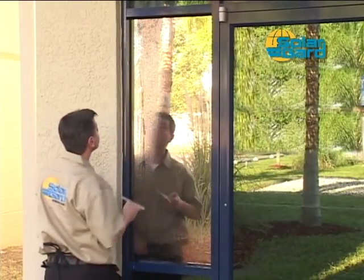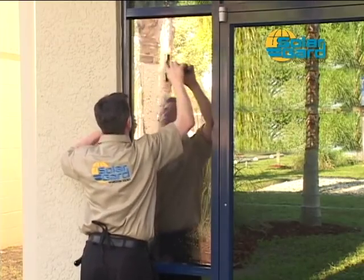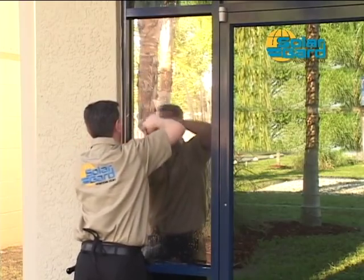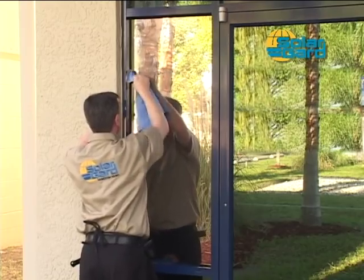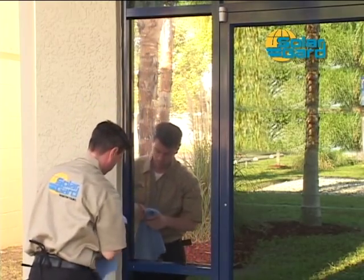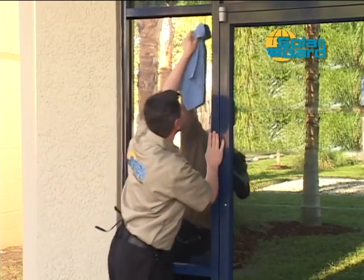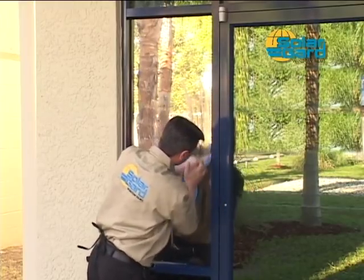Respray the glass and with your squeegee, make overlapping horizontal passes from the top to the bottom of the frame all the way out to the edges. Wrap your hard card with an absorbent paper towel or cotton towel and make a final firm pass along the entire edge of the frame. This will remove the maximum amount of moisture. It is recommended that the glass be allowed to dry for several days before applying sealant to the window frame.